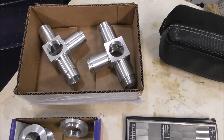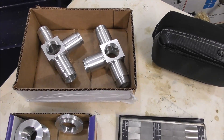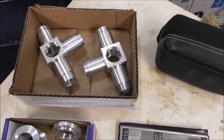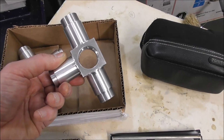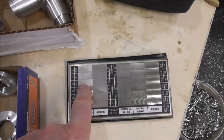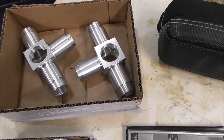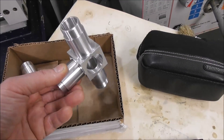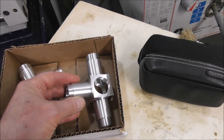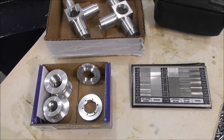Well, that's the second one made and it came out well, but it was pretty stressful — it's quite a relief to have it done. I didn't have any spare material; I ordered spare insurance material but it got lost in transit. Really fine tolerances, surface finish, squareness, parallelness. The surface finish requirement for the diameters was 0.2 — that's finer than a turned finish. Really fine tolerances on lengths and diameters, just crazy difficult. Scores of machine surfaces that have to hit specification without a single mistake or the parts are rejected. Highly stressful, highly challenging work.